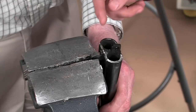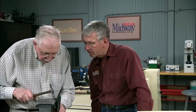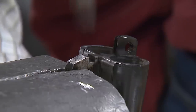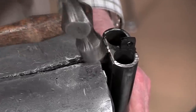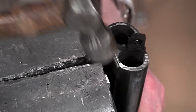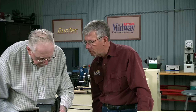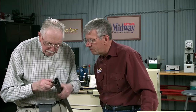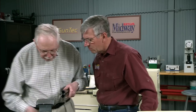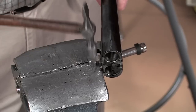What we've done is moved metal up this way just a few thousandths. Now let's flatten that — you can use a smaller hammer for that, flatten it out slightly. Now having done that, a burr has been knocked up on the side, so you need to knock the burr down on the sides and clean it up, otherwise you'll never get it back together.